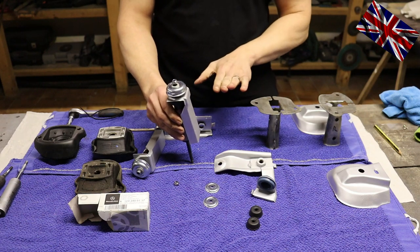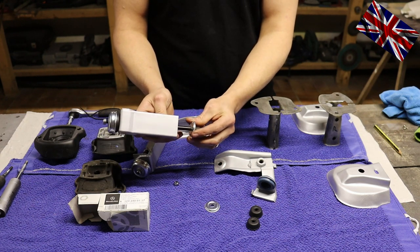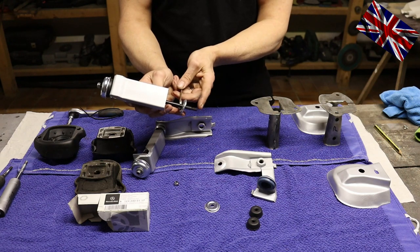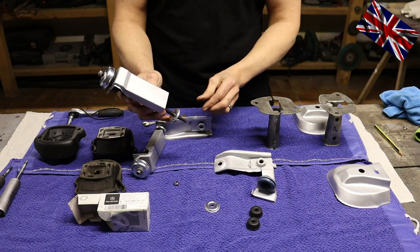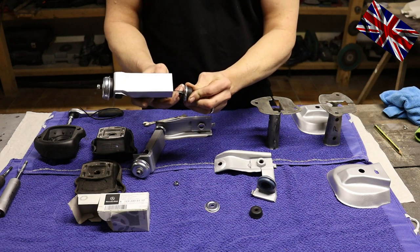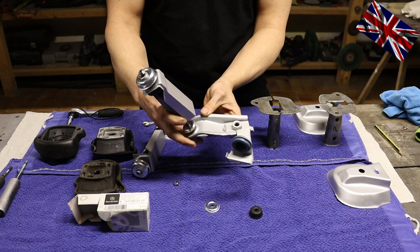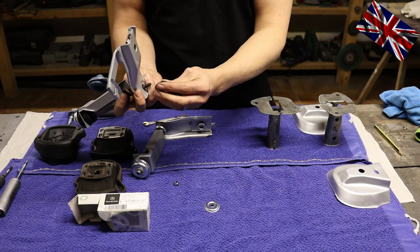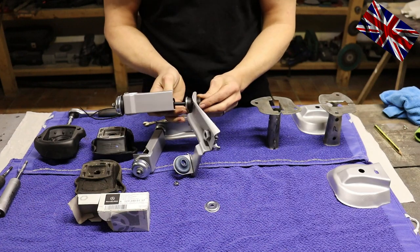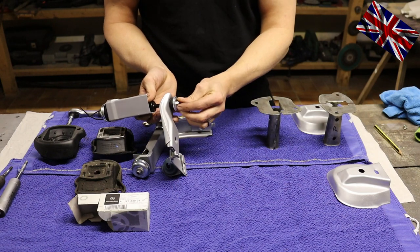The top of the assembly is done. Next, from the bottom: this is the retractable rod of the shock. Add another washer — the smaller one — and note the insertion point to put a spanner size 7 later to tighten it all up. Next: smaller dampener, part number facing downwards. The bracket goes here from below. Next dampener, then the drop-forged washer to embrace the rubber, then the nut to tighten. The lower part is bolted to the engine mount and the upper part to a mounting at the frame. The rubber of the engine mount has no thread to hold the bolt; neither does the protective plate — only the bracket can hold the bolt, which is bolted in from below into a nut welded on top of the bracket.